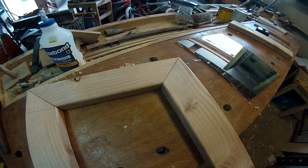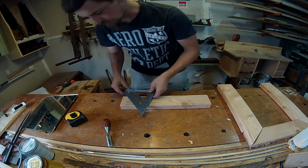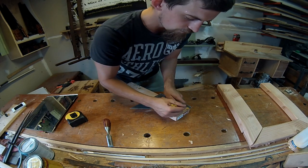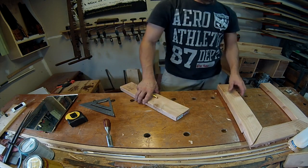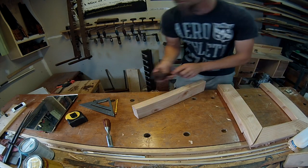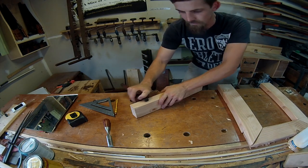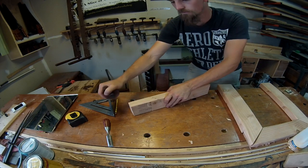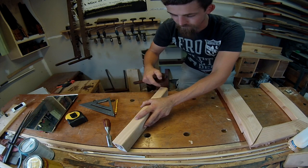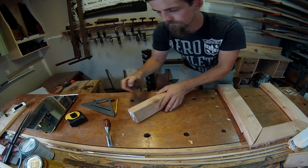Now let's go ahead and do the same exact thing with hand tools. We've got our bottom piece here and we're going to do this quicker — just make each side's mark, one right there, flip it over, one right here. I feel like with a handsaw you've got a lot more freedom. Got a marking gauge, flipping them over, and this is that perfect three-quarter inch. You want to make sure you do it that way, flip it around and do the same mark the other way — it should fall right into the same groove, and it does. Mark right there.